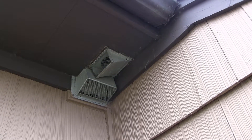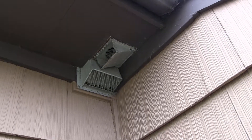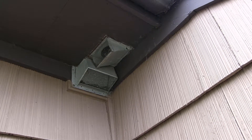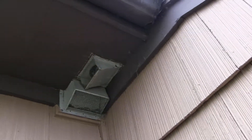It's the bathroom vent — that smaller little vent that's away from the exterior of the house. There are two of them right there. The other one that's closer to the house is for the vent for the range hood in the kitchen. The bathroom vent, which is this one right here, is vented under the soffit.